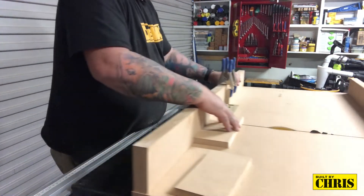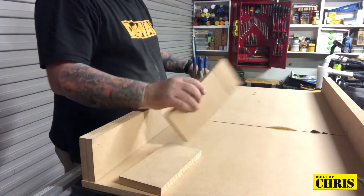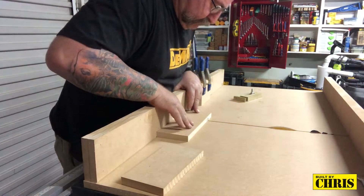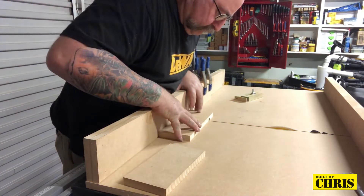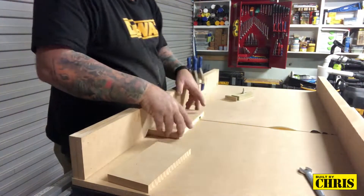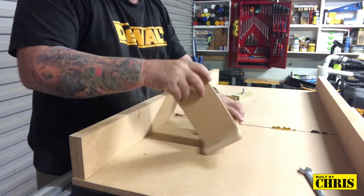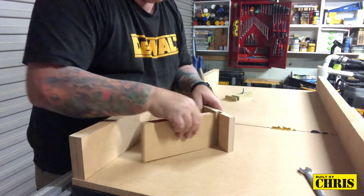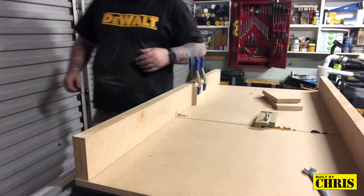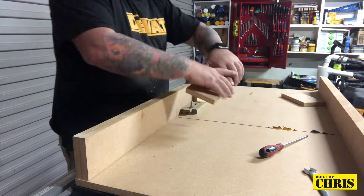With that setup, I make the first cut. There's the first cut. Turn the kerf maker around and make the second cut. Then I just hog out all that material in between — just nibble it all away. When I test the fit, I realize the fit is a little bit loose. So I make a fine adjustment on the kerf maker, putting it back up against the blade and using a screwdriver to make a very tiny adjustment, then run it all through again to see how it fits.